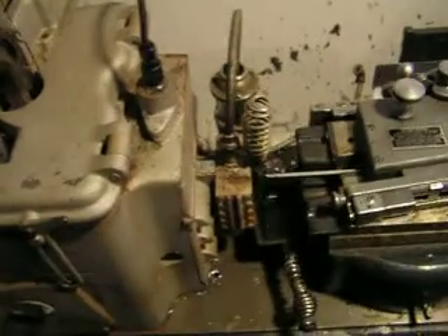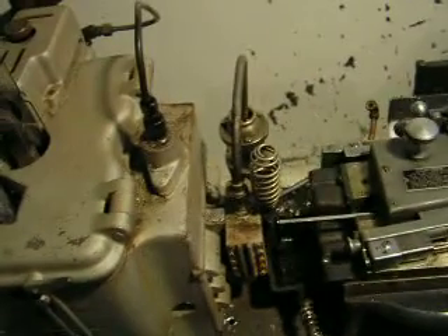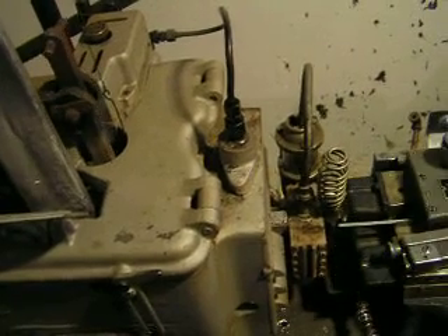This is the mold. The molten metal goes into the mold on the left and gets pulled out on the right as a solid strip of 12-point slug. The jacket around the mold is water-cooled and the water goes through this pipe and down the drain. This other piping here is oil that gets injected into the metal so that the metal can get pulled through. It needs a little bit of oil to help it through.